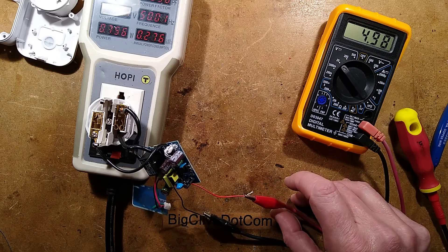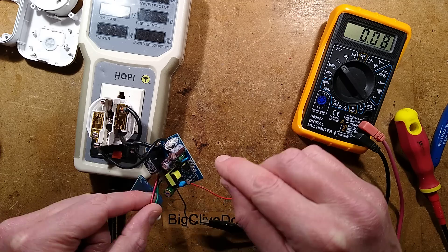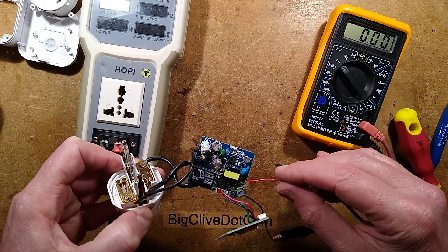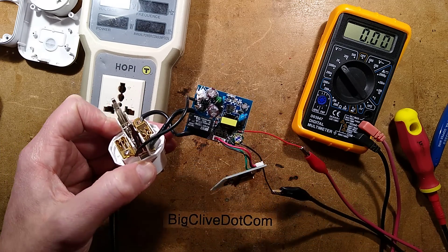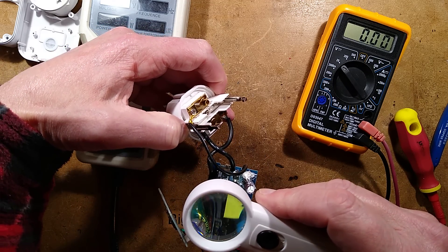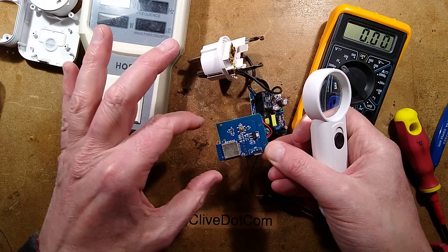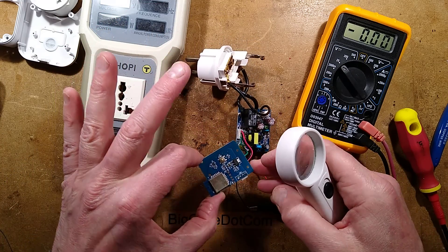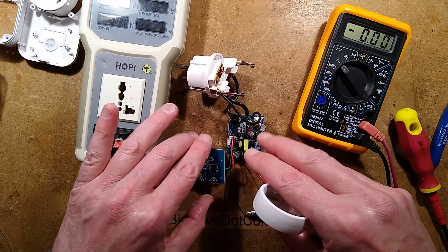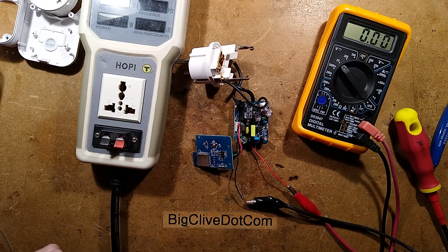I wonder if there's another supply. I'm going to unplug this again. The relay says 5 volt DC so it is being powered directly from this, but nothing is happening on here. I shall just hotwire this with 5 volts so I can operate on it safely, and then we'll measure some voltages. One moment please while I set that up.